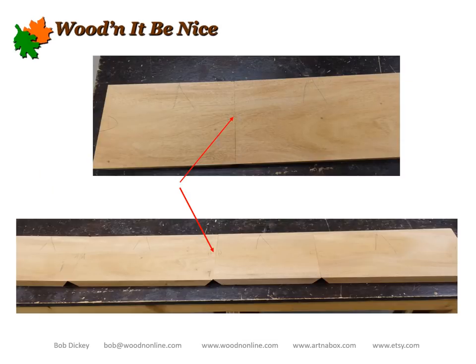The next thing I do is take those sides and spread them out on the table and make sure I get the grain lined up the way it originally was in the board. Then I mark the top and the corners so that when I am routing in the next steps I'll know which side is up, and when I'm doing a glue-up I'll be able to rematch the corners. Knowing which side is up turns out to be quite important — I've learned the hard way by routing at least one side upside down several times.